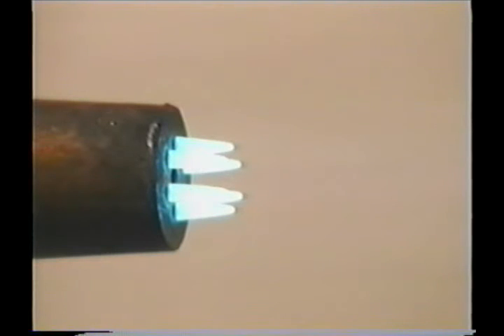I'll reduce the oxygen a little. When you have a neutral flame, push the oxygen cutting jet lever all the way. If the preheat flames change, you can readjust the oxygen a little to sharpen them up.